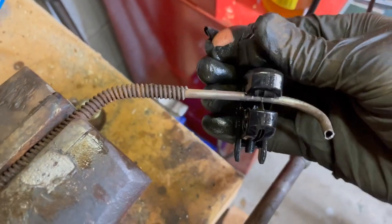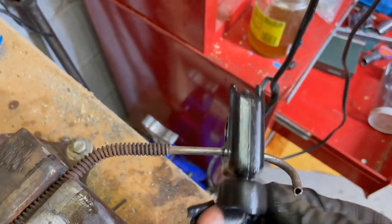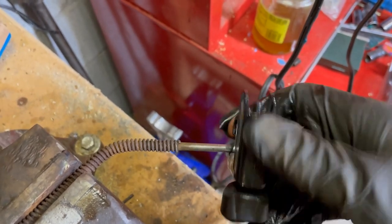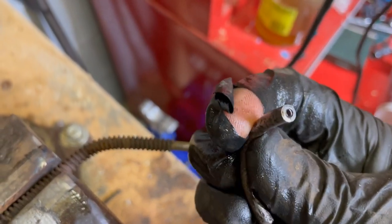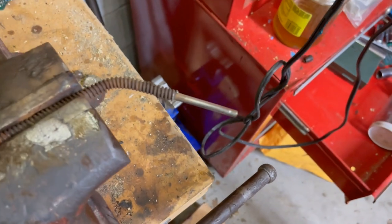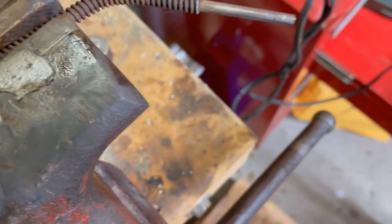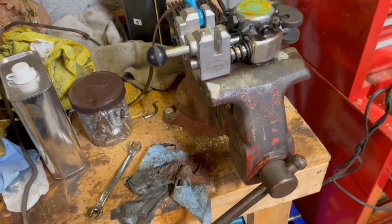I can see I've got a real nice cut going on here. Every turn or so I'm just tightening the knob till it's snug again. There you go - see that? Really nice cut. Now here's the other end - really nice cut. I'm going to chamfer the hole just a little bit, make sure there are no filings in the way.